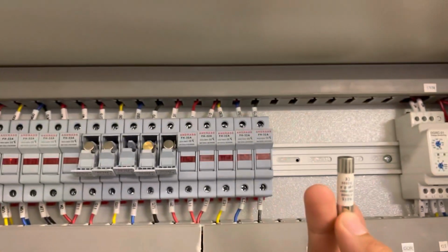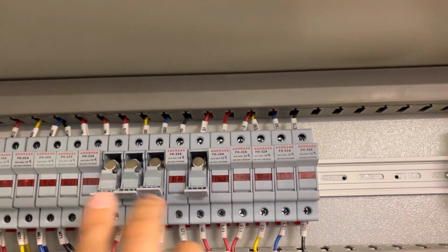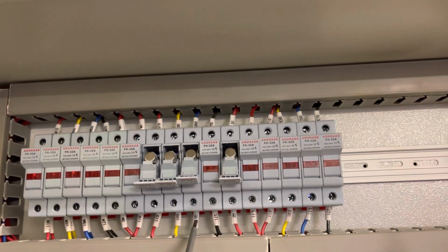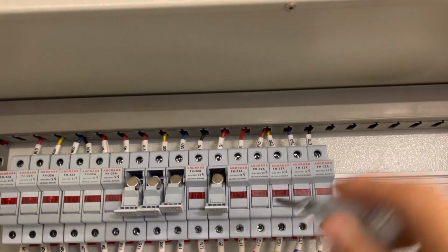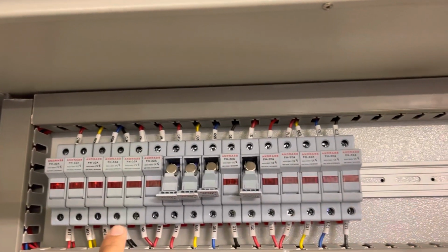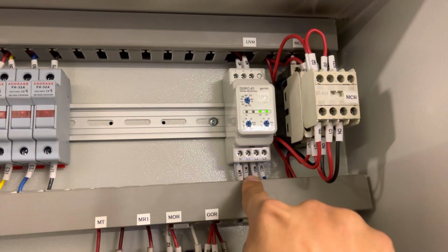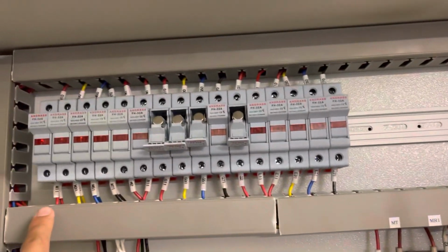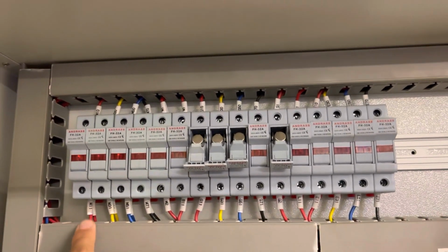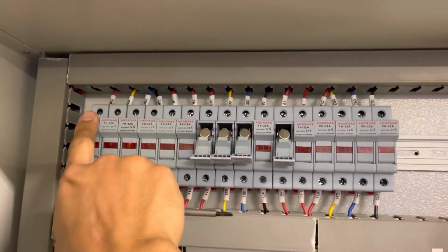The rest of it they use fuse. So neutral cannot open, or you only open the phase only. Okay, G, the rest no issue. This one is going to the essential metering. Then we're going to trigger the UVR. M71, M11 and M31. M71, M31, M11, the fuse over here. I just pull one fuse.